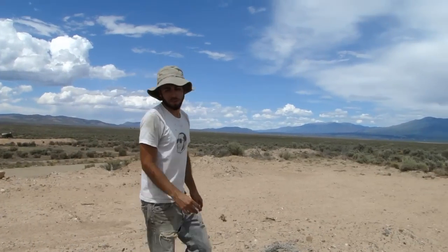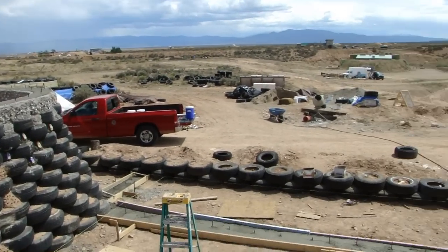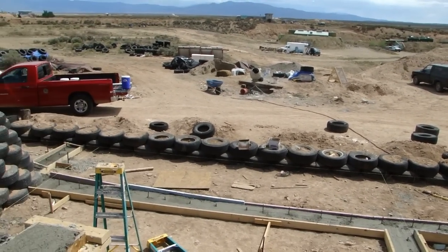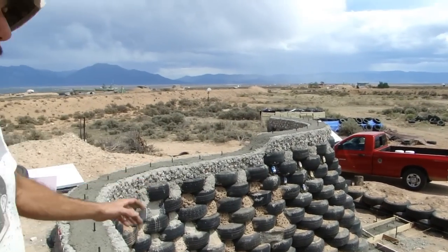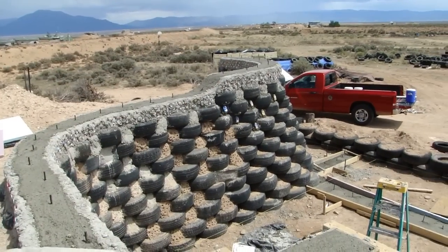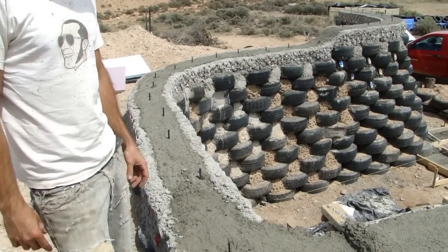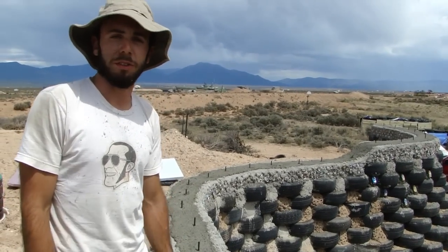So next steps we got going on here. We're going to do that plating. We're going to do the framing on that first footing that you saw down there. We're going to frame out the window boxes and the door boxes. And then next week, today's Friday, next week, on Tuesday, we're going to have a crane out here and get the vigas up on the roof and start doing the decking. By the end of next week, we should have the roof pretty much completely done. And we should be catching rainwater into our cisterns.